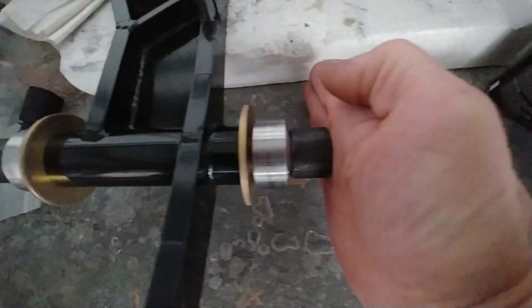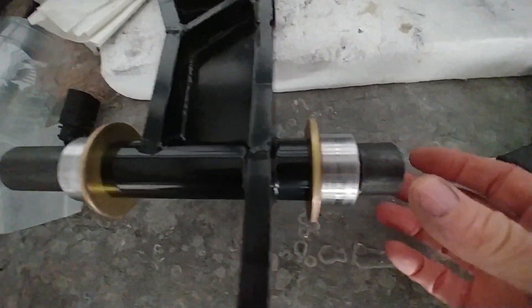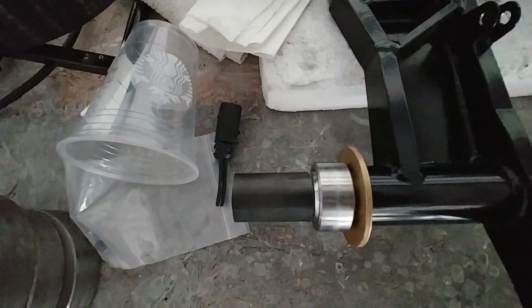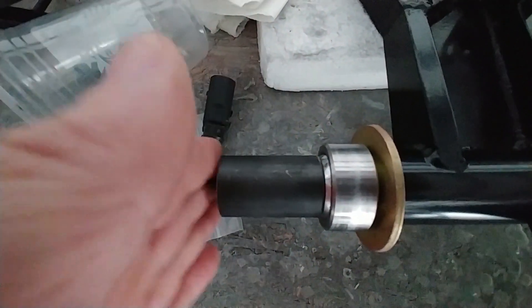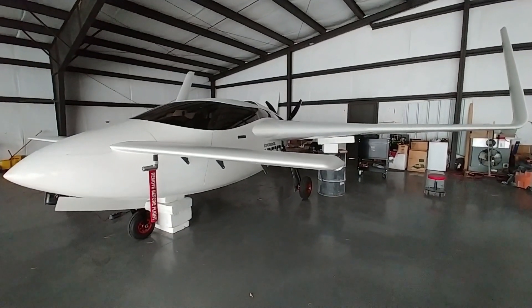This is the setup for how I'm doing this one — the cap broke off and became sort of dislodged, so I'm putting a little spacer in there which is going to hit up against the back wall, which is basically the inside of the main spar. Then obviously the washers, the spherical bearings, and then another cap which goes on the cabin side so it won't be able to move around.